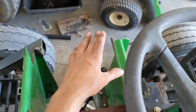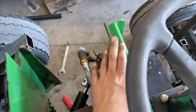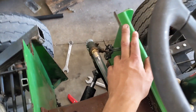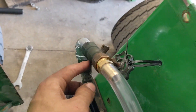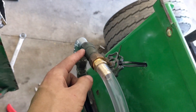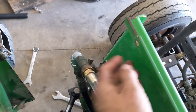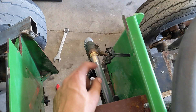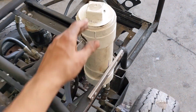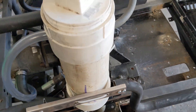I did order a hydraulic valve for the loader part — I just ordered it last night so it's not here yet and I'm not going to wait to run it. I have this cobbled together: I didn't have a coupler so I have this valve that I have zip tied to the dash just to keep it from falling down — definitely don't want to turn that. This three-quarter hose just kind of runs back to the reservoir. The PVC pipe is zip tied down so that's not going to go anywhere.